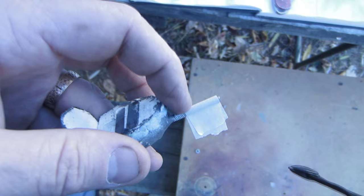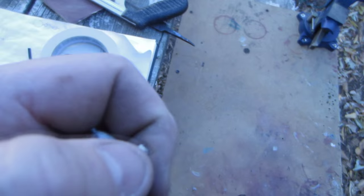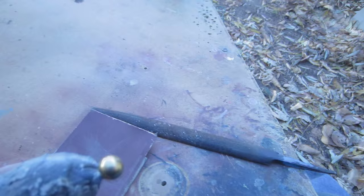So while I'm out here doing this — this is at the back of the head with the magnets — I'm going to need to put a ball right there. A ball sinks in 3/16ths, so I'm going to cut that off a little bit longer than that with the hacksaw, and we'll put a ball on there. Nice little piece cut off. I'll probably need to hit that with a little sandpaper, because when you cut a piece of threaded rod it kind of messes the threads up a little bit.